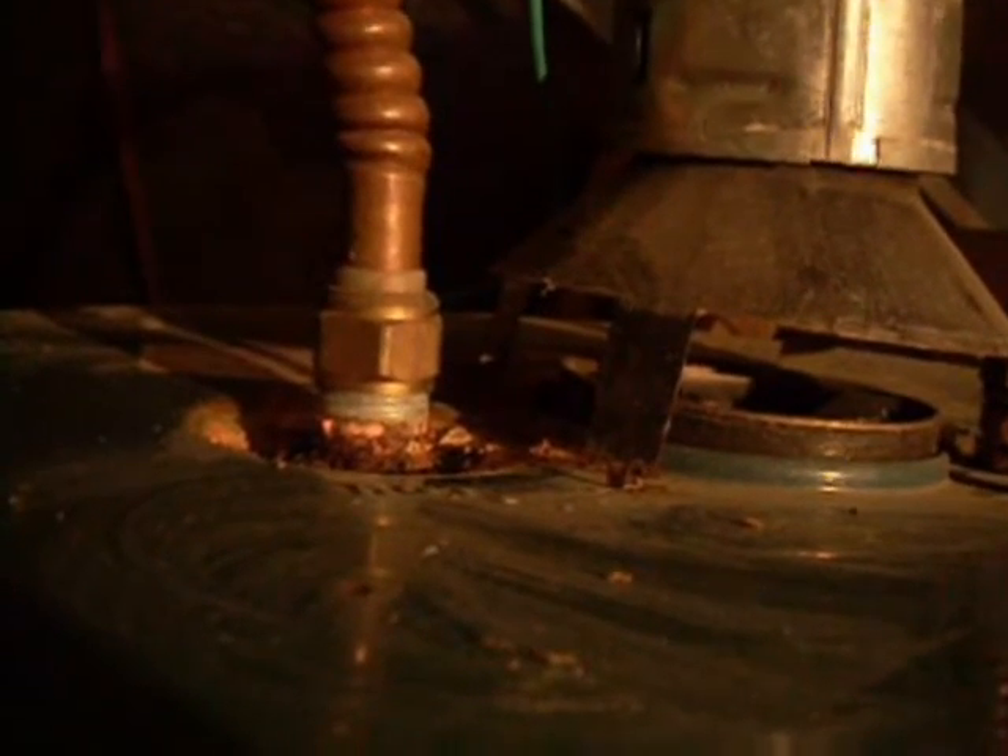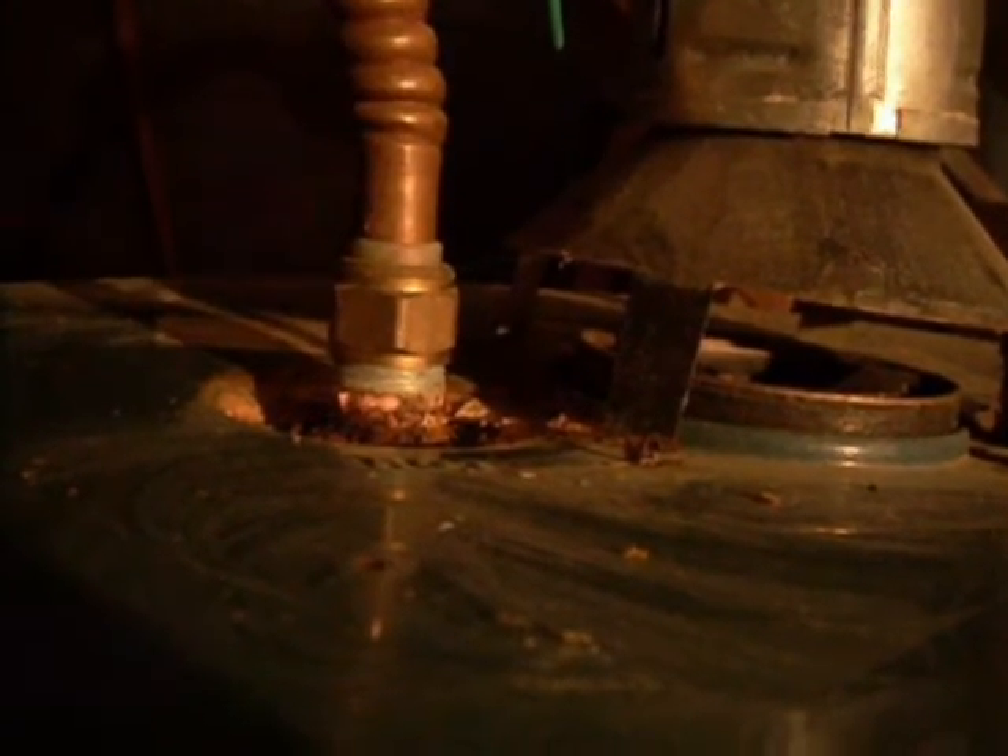This union here also has a considerable amount of corrosion on it. When we come to the second water heater, on the left of it you can see the valves — there's no leaking and the valves are in good condition. This is to do with the first water heater effectively protecting the second one from damage. But once this water heater is exchanged or swapped out, this one would need to be done at the same time, because damage will occur here.